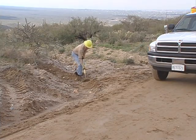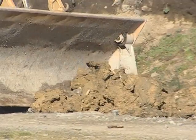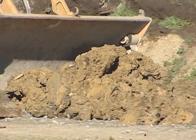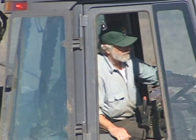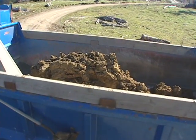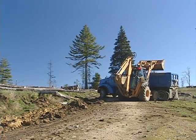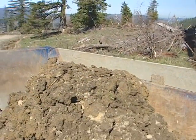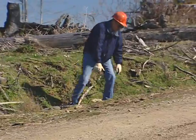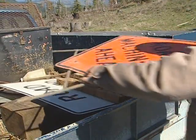When you've finished cleaning the ditch, use hand tools to clean any culvert inlets, lead-out ditches, or drain pipes. You're now ready to remove the accumulated debris from this section of the road's shoulder, usually with a loader and a dump truck. When you're working with a partner on the ground, be sure you know where that person is at all times. When loading into a dump truck, position the truck uphill from the loader — this will provide greater stability while loading. All collected debris must be taken to an approved disposal site. Replace any rip-rap or ditch dams you've removed, then check your work and remove your traffic control devices and safety signs.